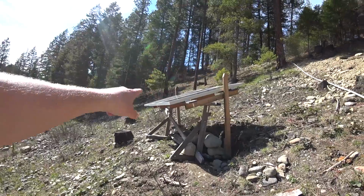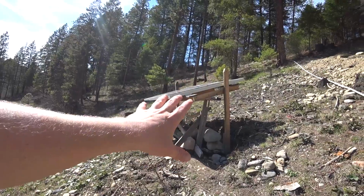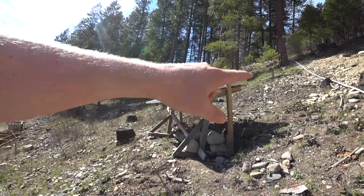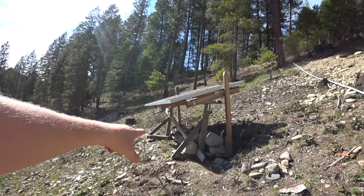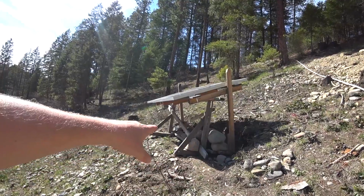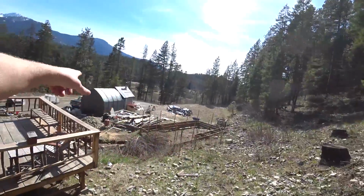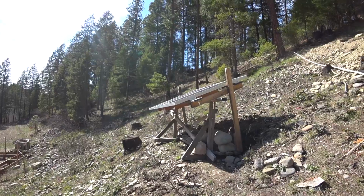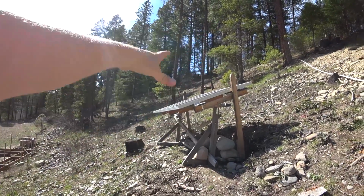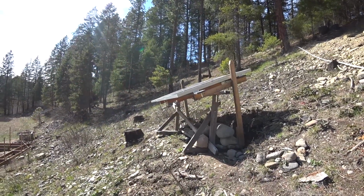Another takeaway from our winter solar fun was you need to have room around your solar panels if you're in a snowy climate. Well, I guess in any climate. As you noticed earlier, trying to adjust the panels, there's nowhere to walk. We originally leveled this off to put rain barrels here to use for gardening. And we thought, oh, we'll be genius to keep the solar panels out of the shadow from the cabin. We moved them up here on the side of the hill, and it's worked perfectly, except for there's no room to walk. So clearing snow from the panels, and as you just saw, even trying to get around them to adjust, very, very difficult. Well, we have a lot left to learn about solar, that's for sure.